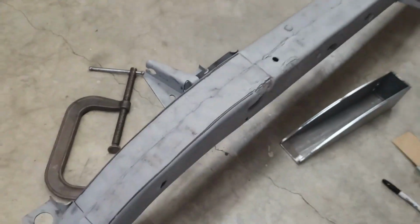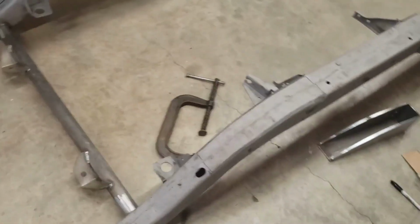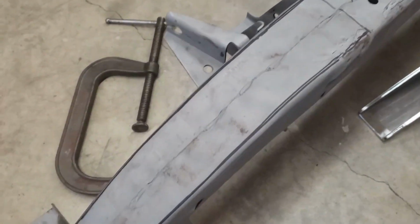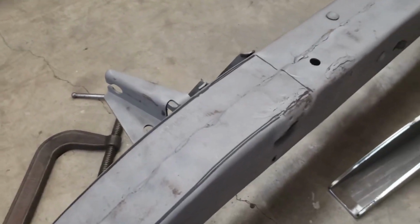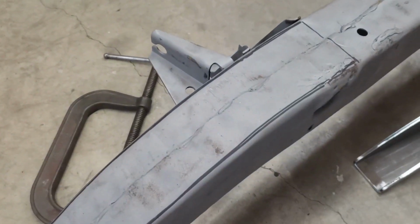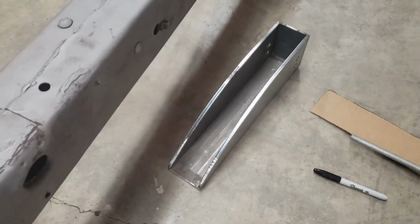I came out here a little bit ago. I've been helping my son work on his door. But I got this laid out where the second one's going to go. I stuck that all thread through the holes to get lined up, and that's why that one's only tacked, in case I have to move something. Basically I'll make sure the second one just lines up with that one, so I shouldn't have to move it. So we'll get this hole cut out and then start shoehorning that pocket in there.